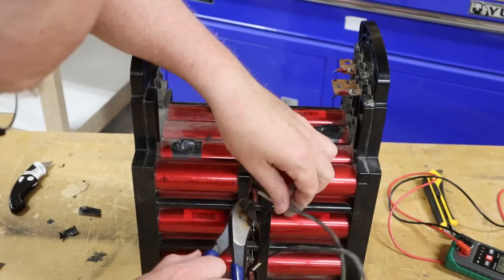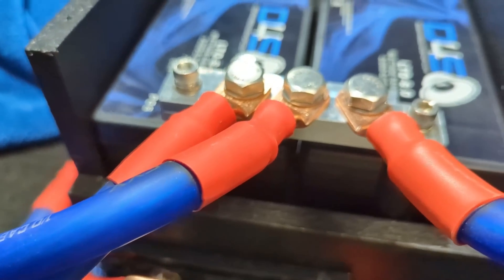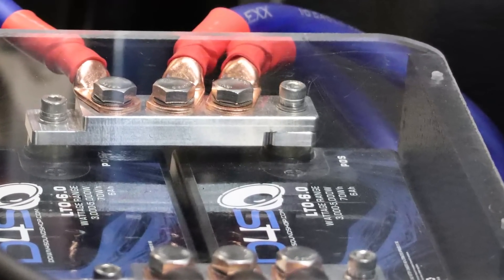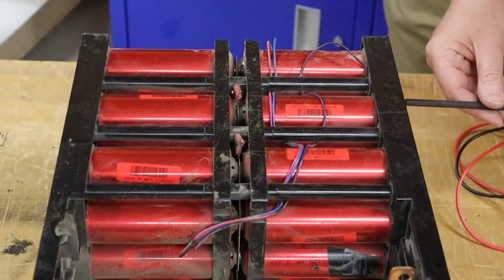This is why you do things like install grommets when you pass your power wire through a firewall, and you always use a fuse on any wire connected to any battery. When I install these Down for Sound batteries, I make sure to cover the terminals with some plexiglass to lower the chance of something falling on them and causing a dead short. If you're not comfortable disassembling and reassembling this pack, I'll make sure to give you some recommendations for ready-to-go pre-made batteries later on in the video.